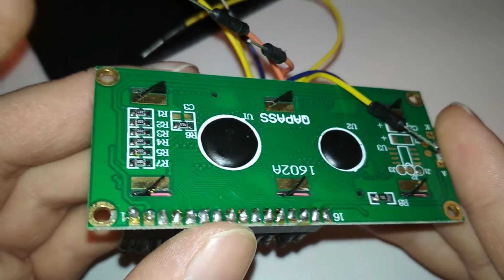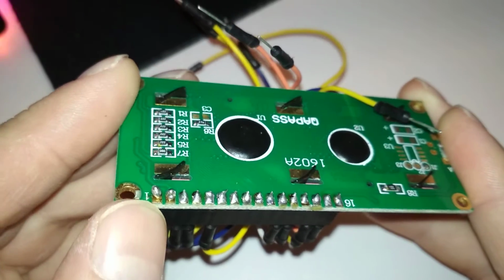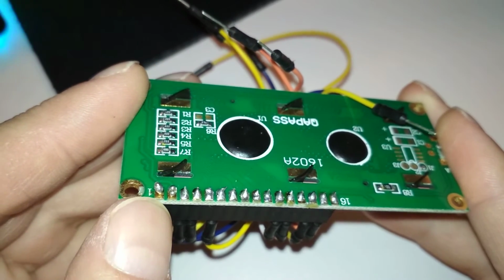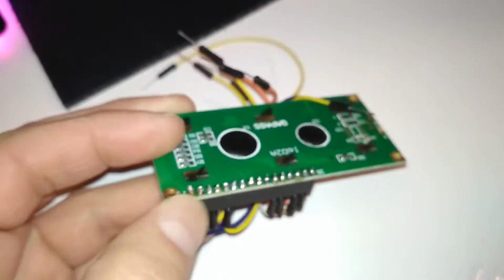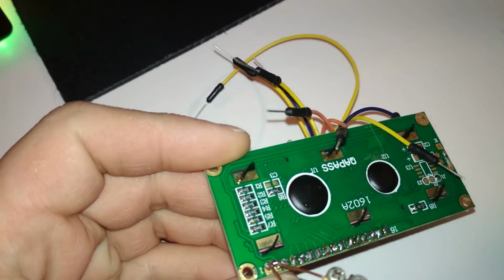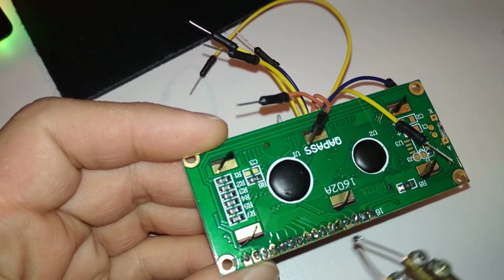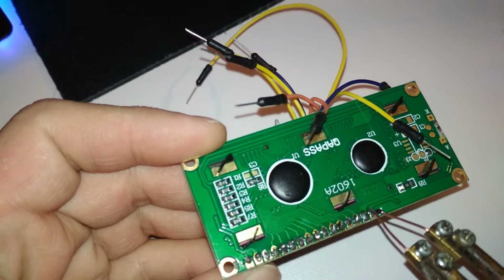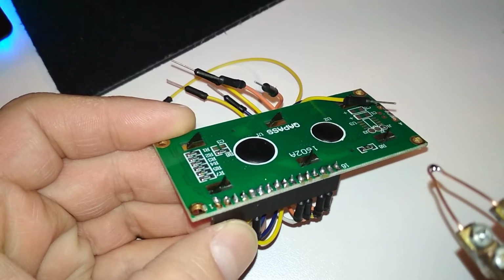So, as Rossmann would say, I don't know what he would say, because he uses other tools. But these soldering irons that are basically a transformer and a piece of copper wire that heats up, these need to touch both the pad that you're trying to solder and also the pin or wire that you're trying to solder into the hole. So here, somebody only touched the pins with the soldering iron, whichever variant he used.